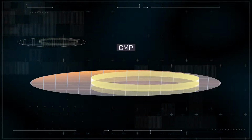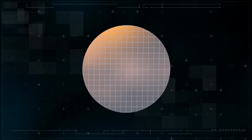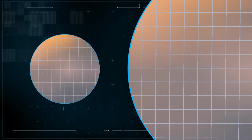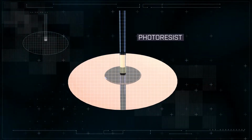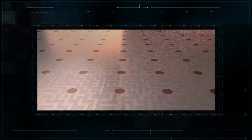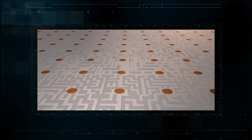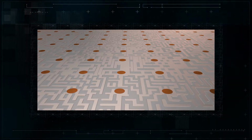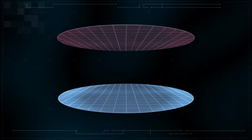After each wafer is sufficiently planarized, the analog wafer requires an edge trim to ensure structural integrity during the thinning process. The DBI layer is protected with photoresist during this step. The photoresist is subsequently stripped from the front side of the analog wafer, and both wafer surfaces are then plasma activated and cleaned. Then the front sides of wafer 1 and wafer 2 are bonded together to form the bonded pair.